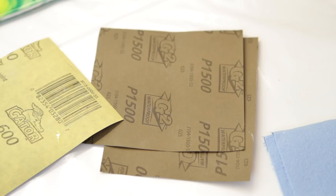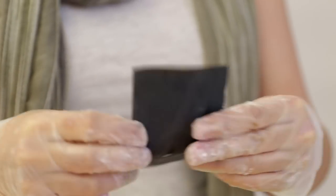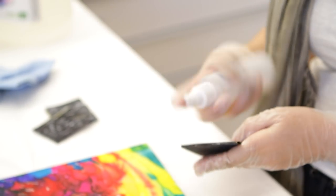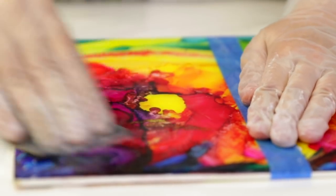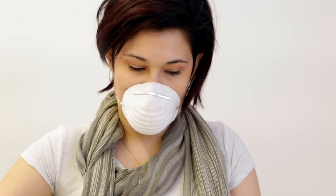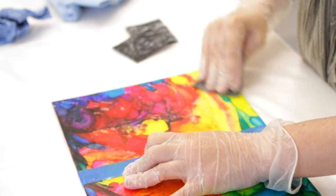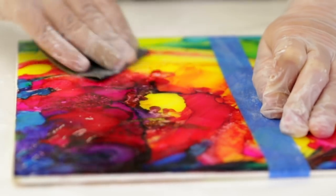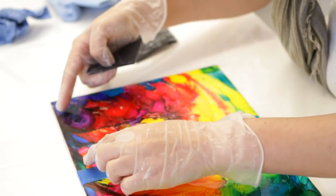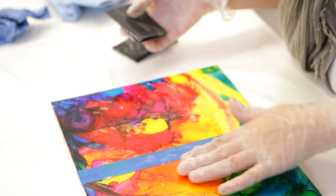Now we've done our 600 grit, we can move on to 1500 grit, which is almost like a polishing grit. You're not gonna feel a lot to it, but it just helps to finish it off and get any little snaggles that are left. As you're going, let it get dry and that's when you'll be able to see your matte effect — you can assess whether you need to go back to a previous grit or if you're happy with it. Work it until it's as tight as you can get it so you don't see any large scratches from the 600 or the 300. That's how you buff it up — it can take a bit of time but it looks really nice at the end.